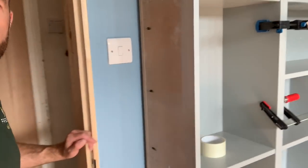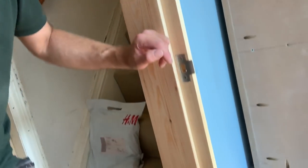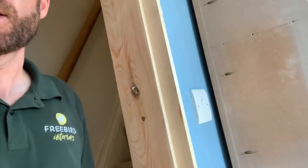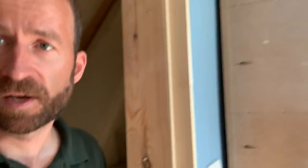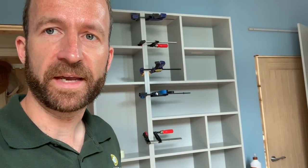We're usually designed for a 20mm gap to the wall — that's just how we do it, because that matches the base unit, which allows for a skirting. It's our standard because sometimes the wall leans, and 20mm always accommodates the worst lean or bulge. So we design everything around that — you've got a void there, but then your cover panels on the side are oversized with an extra bit of scribe, so they'll always cover that gap and just finish it off, making it fully fitted.